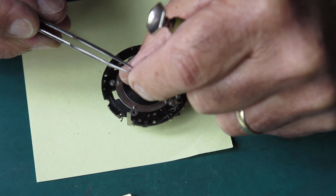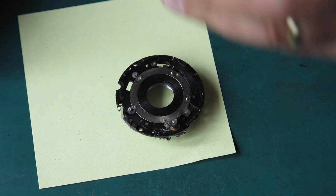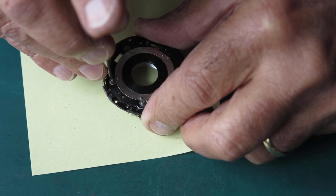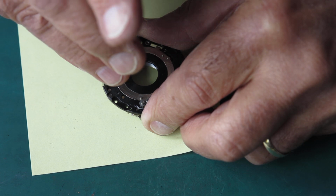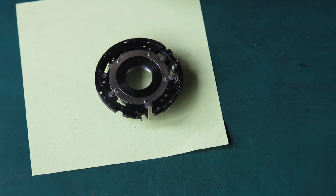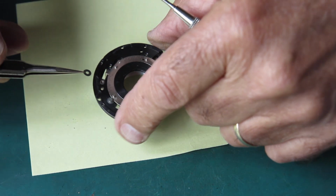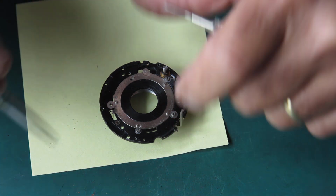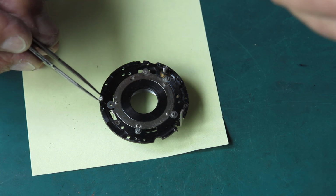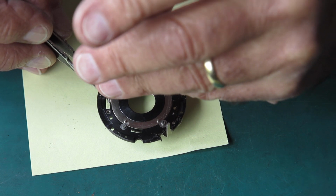These screws should all be the same length if you're very lucky. That screw didn't really want to start nicely. That's why I had to back it up once or twice until it's seated correctly. As I say, they're very short, and the aluminium shutter body mechanism plate is quite thin.